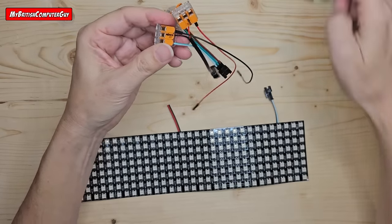Okay, and as you can see, only the first 29 or 30 LEDs light up. That's because on a freshly flashed ESP32, WLED does not know how many LEDs we're actually working with. And by default, I think it defaults to either 29 or 30. So we're going to go ahead and connect in to our WLED app within the ESP32 and take a look at the settings.